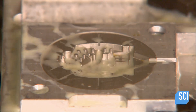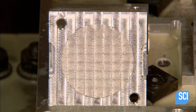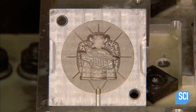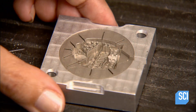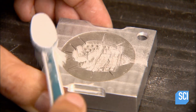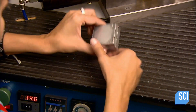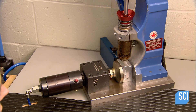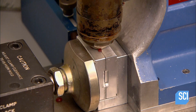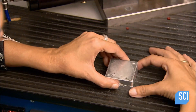The machine transforms two blocks of aluminum into a two-part mold for each of the flat detailed components of the ring — meaning all the parts except for the base. A steady flow of lubricant washes away the metal shards as the machine cuts away bit by bit. The mold assumes very intricate detail of the ring design. Once finished, they coat the cavity with a powder that prevents the wax from sticking, then load the mold into an injection device. It shoots in hot liquid wax at high pressure, filling all the minute nooks and crannies of the intricately detailed cavity.